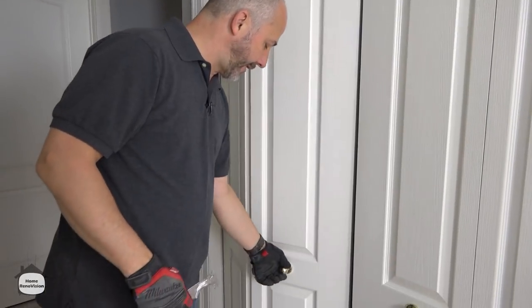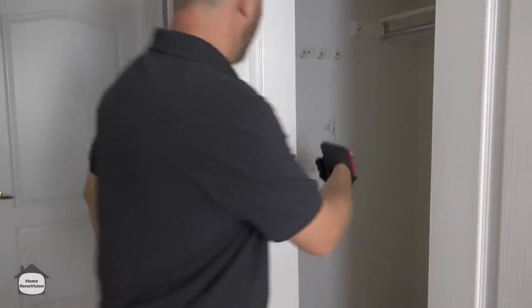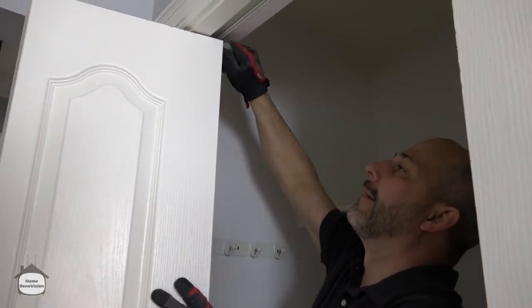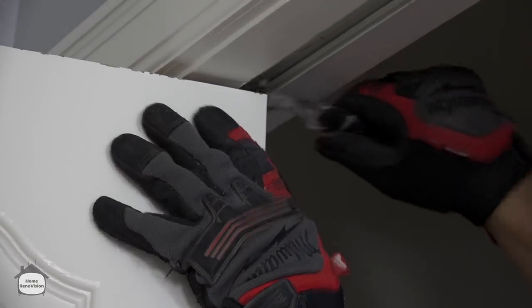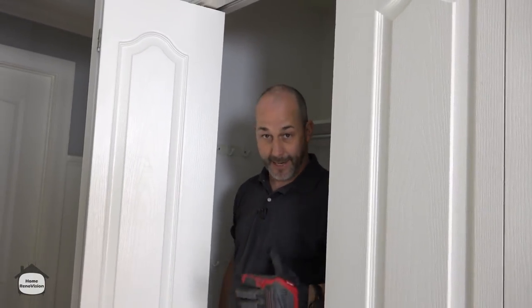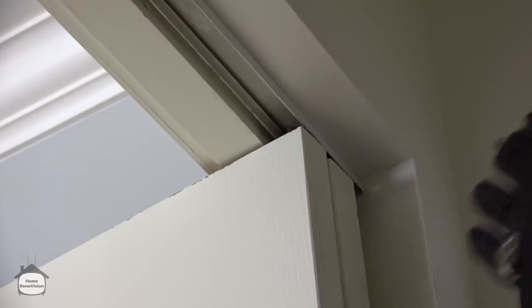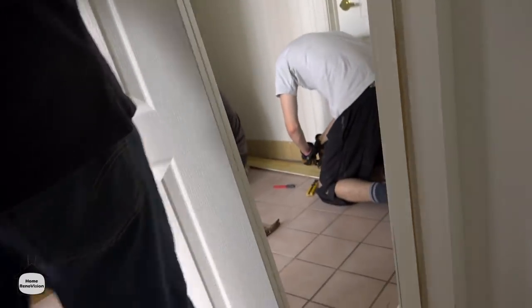So bifold doors — this one is not in the greatest shape. This closet was framed properly, the doors are standard size, everything was normal until they added so many layers on this floor that nothing works. The door has a pin on a spring that's supposed to be sitting in the bracket — it's not there. This is the screw you need to remove so it moves, then close the door, slide it forward until it pops out, and lift it out of the footrest. All of these parts are available at the hardware store for just a couple of bucks.